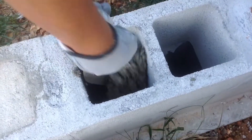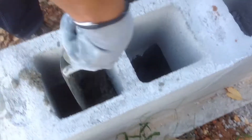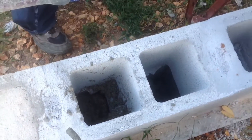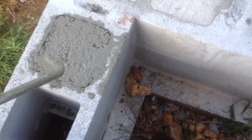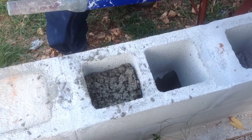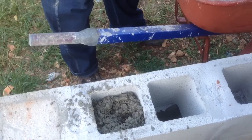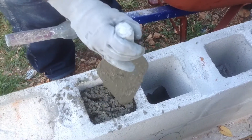We have two levels of blocks filling up. You need to shake the concrete down in there, and once it's in you can use a J-bolt — I mean an anchor bolt. There's not much light so you can't really see down in there, but once she gets it filled up she'll level it off. Notice she's got a glove that's rubber-coated on one side — those are great. They're cheap; you can buy them in three-packs for about $4. You can find them at Walmart, Menards, Lowe's, or Home Depot.